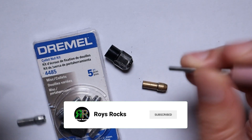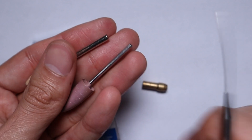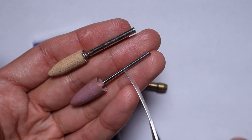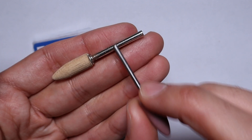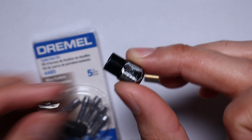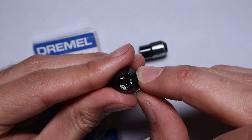If I want to change between the two most common sizes - this larger one here is a 3.2 millimeter or 1/8 inch shank, whereas this nova point has a 3/32nds inch or about 2.38 millimeter shank - at times I'm switching backwards and forwards between these. Most rotary tools come with the larger shank mounted straight away. Every time you want to swap over with collets, you've got to take your nut off the tool, select the right collet, take it off, chuck the other one in, screw it back on. It becomes quite tedious.